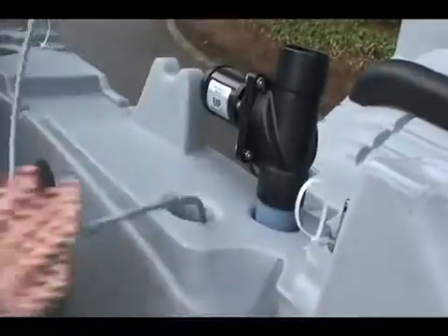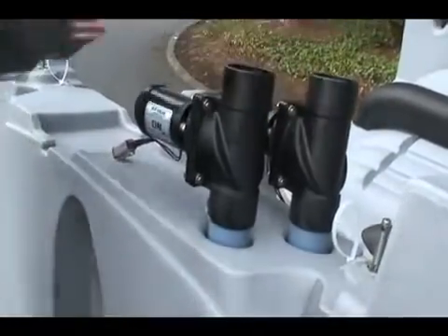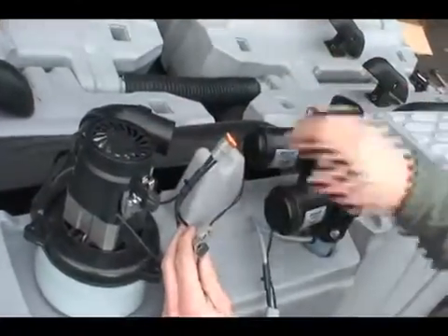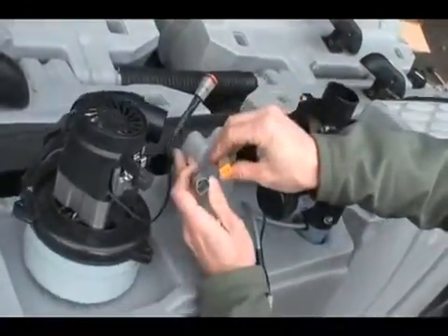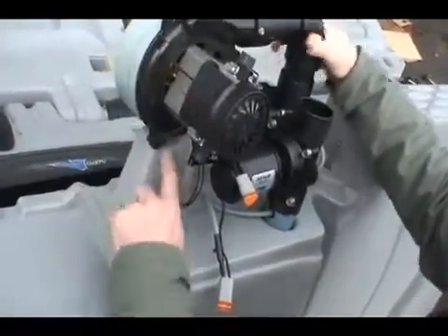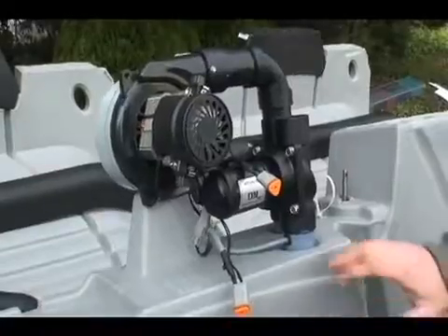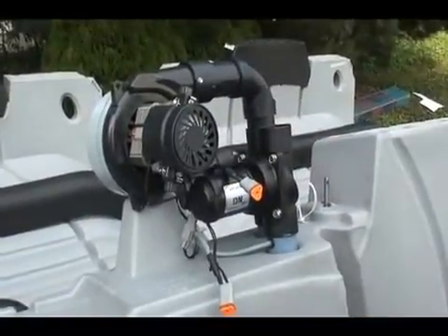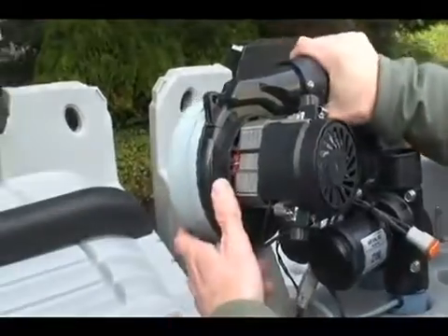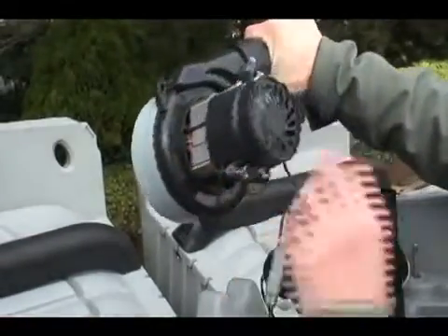The TMS tank monitoring sensor will go in first — only light pressure is needed. Next, the blower will go on the up valve. First connect the wires, noting they are a two-pin wire, not to be confused with the four-pin or the three-pin. The blower will rest on the cradle with the ear on the outboard side. Complete the same procedure for the other three tanks. For salt water applications, use corrosion spray on the blower, on the motor stator, and lightly into the fan.